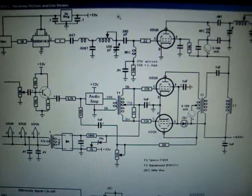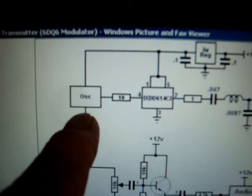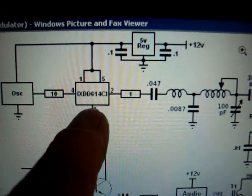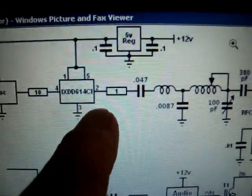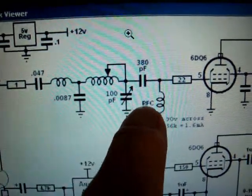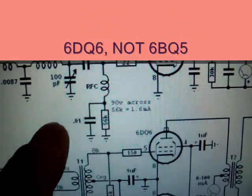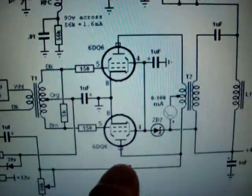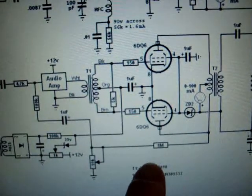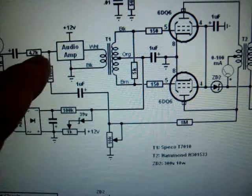Here's the overall schematic of the transmitter. The oscillator circuit drives the driver chip — that one we saw. And then here's the matching circuit I made for it. Over here we've got it driving a 6DQ5. And then the wonderful modulator. You can even have some negative audio feedback to keep it as linear as possible.